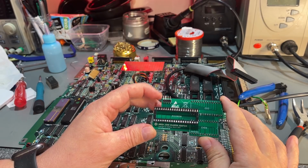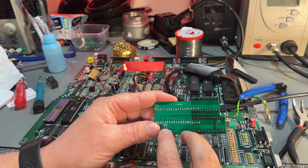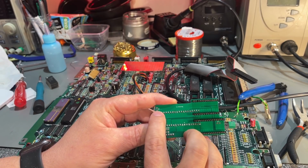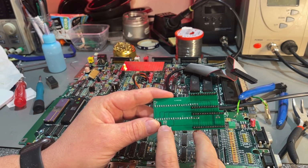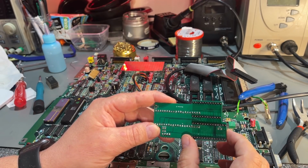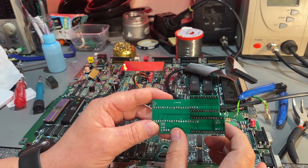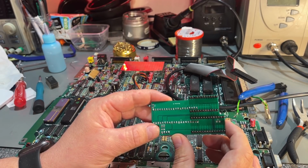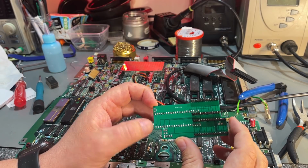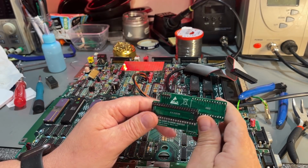I couldn't really find any good recipes for installing this online. I found one, but I actually discovered now that there's a place for 2 resistors and 1 capacitor, so that's probably a smoothing capacitor and maybe 2 pull-ups. Yeah, there's one there too, C2, but I could not find any information whatsoever about what values those are. So I sent a question to Amiga World on Twitter, and they replied that this is 100 nanofarad capacitors and 10k resistors, so that is probably correct, hopefully.